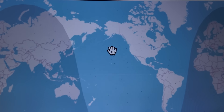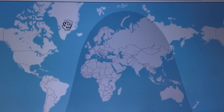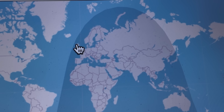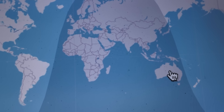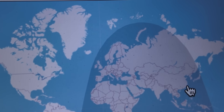It brings up the map. The UK is up the top there — we're in darkness now — and if we go down to Australia, you can see it's just about to be sunrise. There's no sign of my signal at the moment because I haven't put a signal out. What we need to do is send out a test signal. You can send CQ, but 'test' is better because if you send CQ you'll get replies, and at this point you don't really want replies — you just want to see what the beacon says.